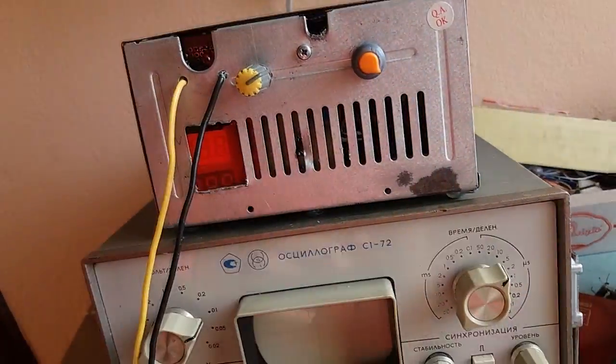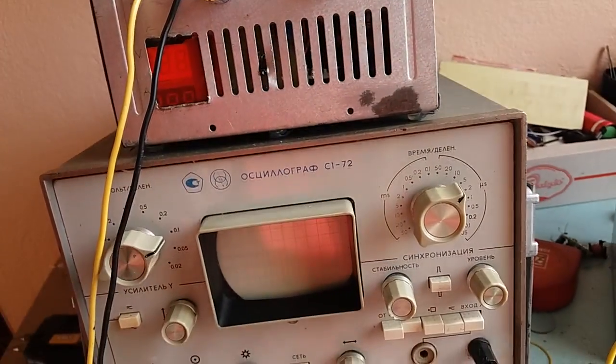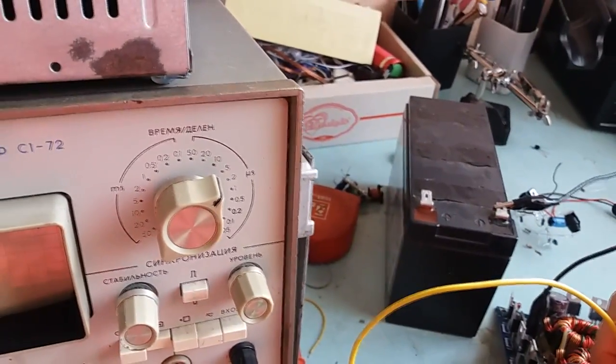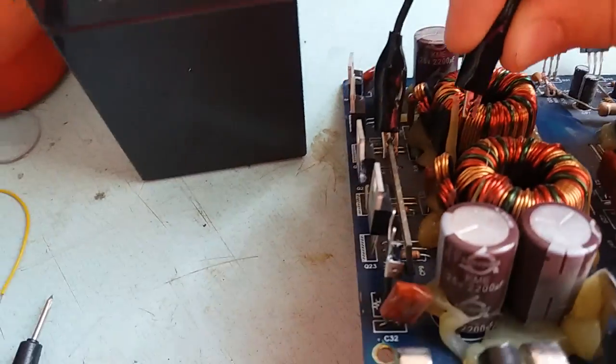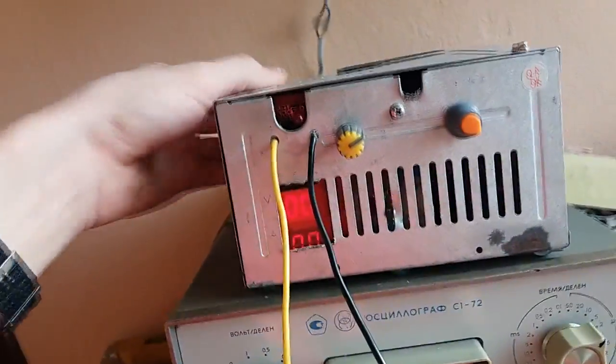Let's connect it up. I connected it first to my power supply, but this tops out at about 2 amps. Not really enough for it. The thing, without any load, this supply is perfectly capable of powering it. It draws 1 amp without load. Actually, this video is gonna get long, but I can show you. This bus bar is actually the negative as a battery, so I can use it conveniently and connect the positive here after the fuse, but this supply is current limited, so no trouble.